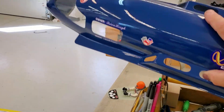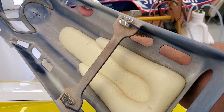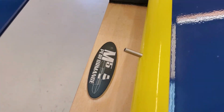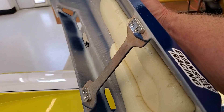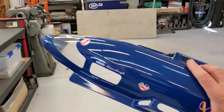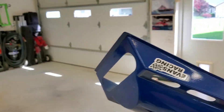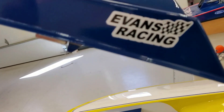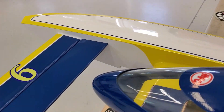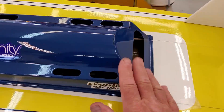You want to make the cowling - don't call me, I won't make this for you. I have the mold because I made the mold. I made a plug, made the mold, made the cowling. It's very very light. It's got pour foam in it at the back; the front has foam where the pin mounts to the front. When it pops off I want it to float tail end up - if somebody hits it they can tear the back off and go finish the race. If it falls in the water I want it to float. Snap - it's on, snaps down into place.